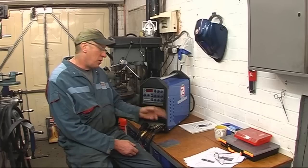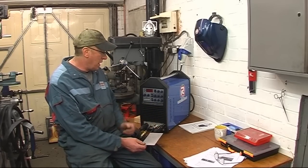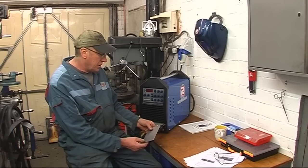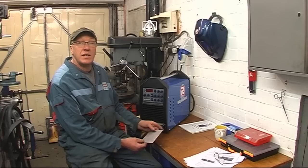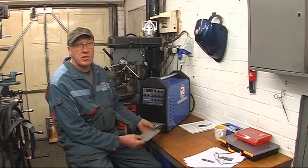Which is why we use an alternating current — AC — to weld it. Alternating current means it's switching between positive and negative; the electrons are going ballistic, jumping in and out of the metal. We use the AC alternating current as a means of breaking down the surface film of oxide to enable it to weld. That's why AC welding works — it's got a self-cleaning action.